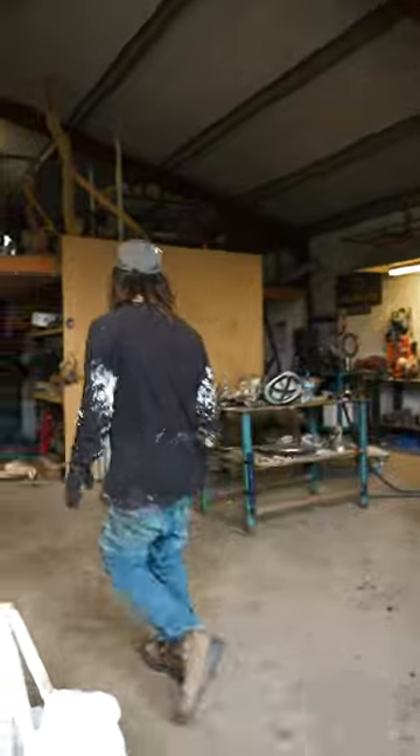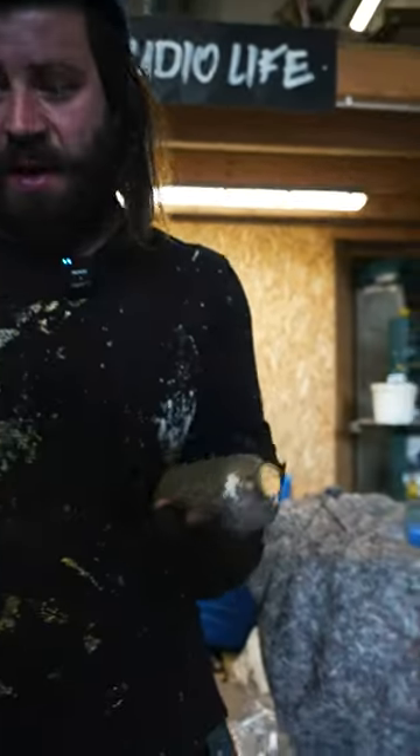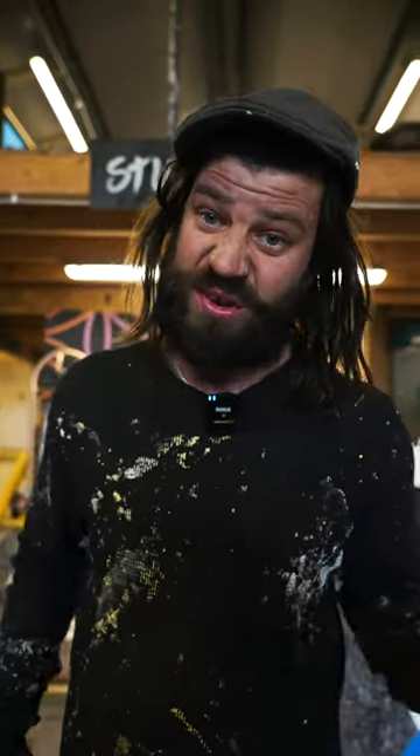So I'm just going to get another section now — just get one of these bad boys. You can get old cuts, cut them up, and then we just pop them on top of the furnace. The moisture then evaporates out of the metal, then we pop it in the crucible, and then hopefully we don't get any explosions.